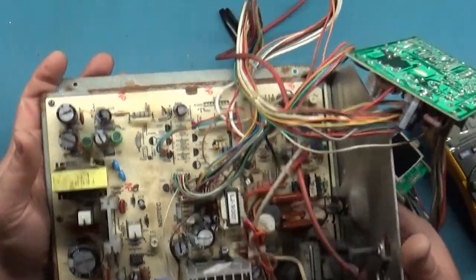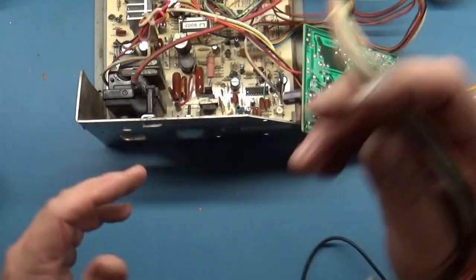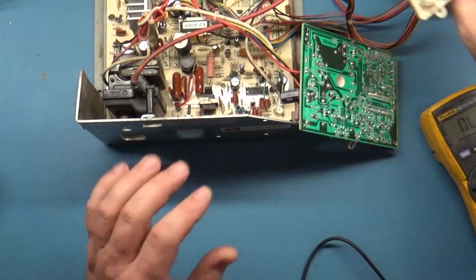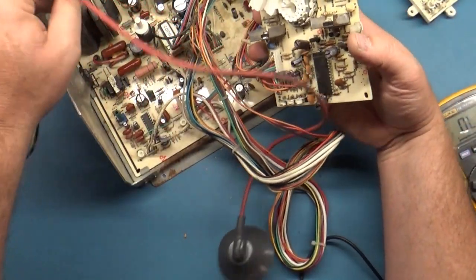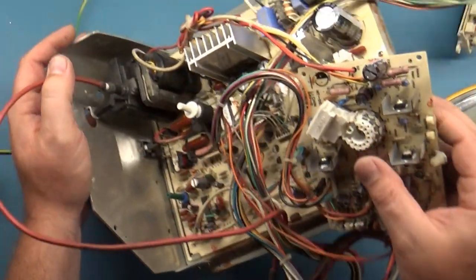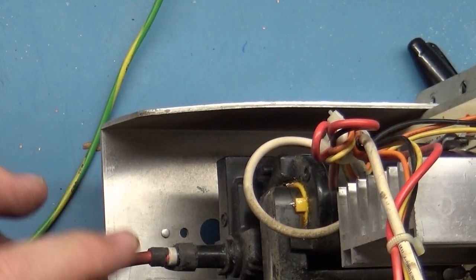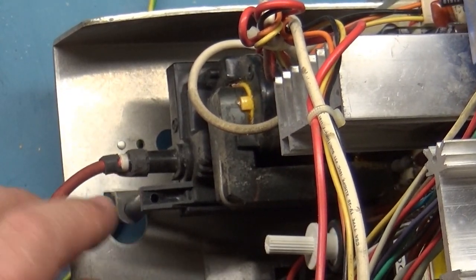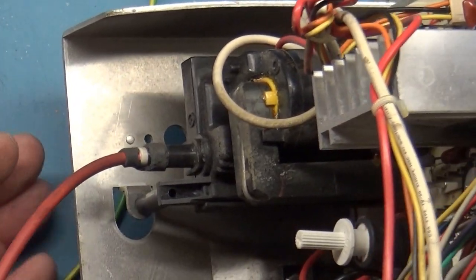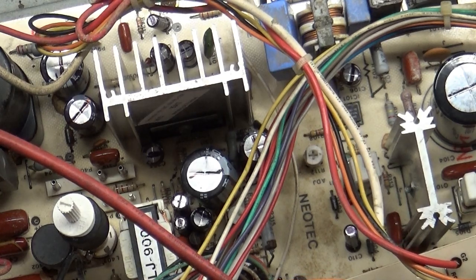Okay, well, let's just go ahead and plug it into a tube and see what we get. First things first, though, we already inspected our pots, so those should be okay. But let's make sure that we get... Oh, well, that's not good either. I just noticed this. The rubber boot is annihilated here. It's got the nylon security piece in there, as well as being sealed. So it should be okay. If it's not, I have a flyback off this donor one that I can steal from. So this thing is pretty haggard.